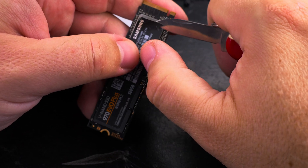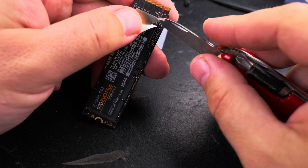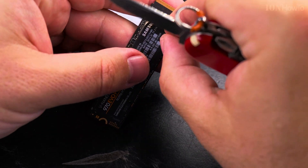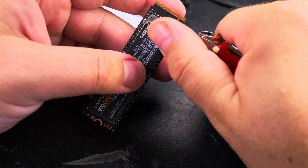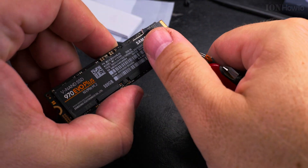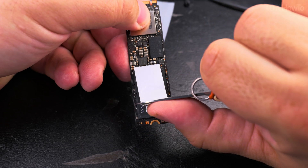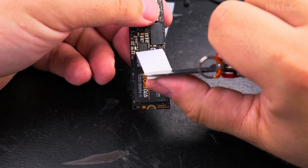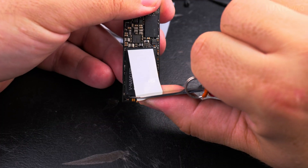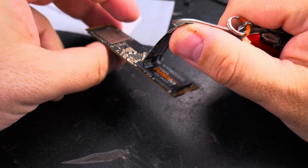This part is metallic — it has a metallic cover — so it's really good to start there. You'll see the label even has these cuts on it to make it obvious that you removed it. The way to peel the label off is to do it sideways like this. Don't pull upwards, so you don't put any pressure on any of the components that might cause them to be removed.